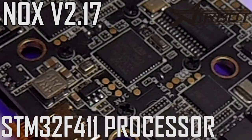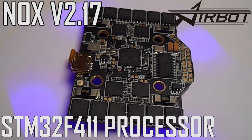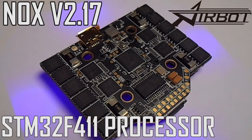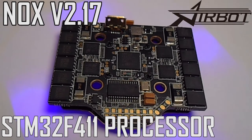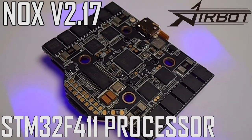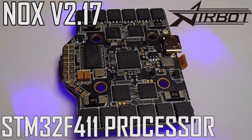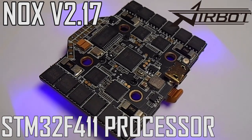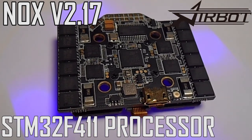This flight controller features an F411 processor with a Cortex M4 core, full speed USB 2.0, and extremely low power consumption. The F411 processor is technically not the most advanced, but it's perfectly suited for this flight controller. It can do everything you'll ever need without including unnecessary extra hardware features that would only complicate things. When we look at more advanced processors, things get complicated with additions like LCD screens, random number generators, data encryption, or ethernet interfaces. So this processor might be considered entry level, but that's what they said about the MPU 6000 gyro — and it's become the most stable and reliable gyro to date. Airbot specifically chose the F411 for its characteristics.